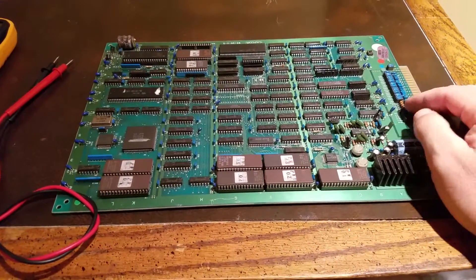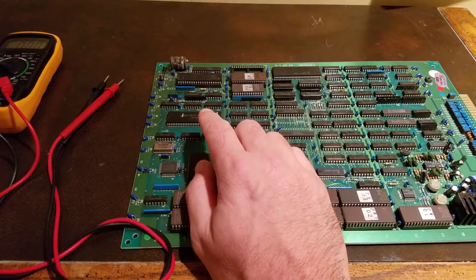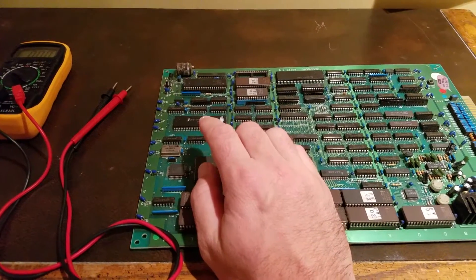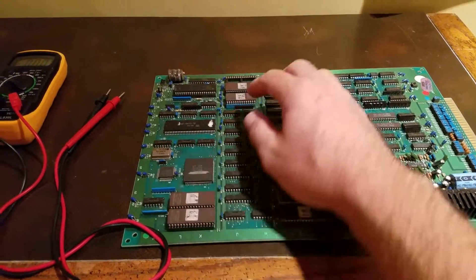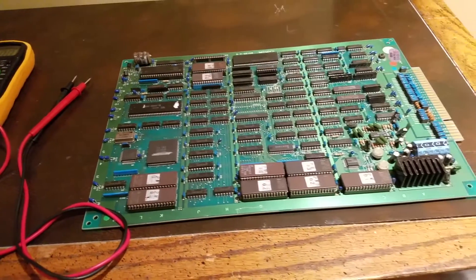The game's not really that expensive. I think my son would like to play it. I tested the battery — it should be 3.6 volts, but it was at 0.45 volts. So obviously the battery is dead, and it erases the encrypted codes on here when the battery goes dead. It's similar to the CPS2.